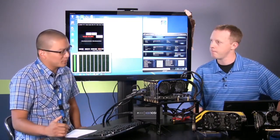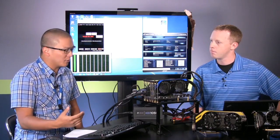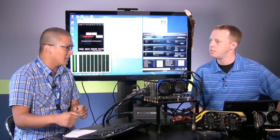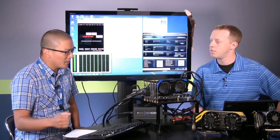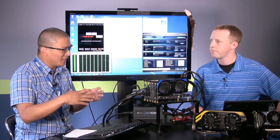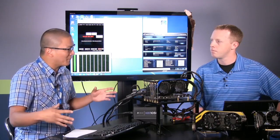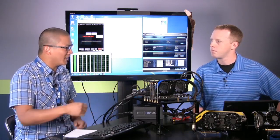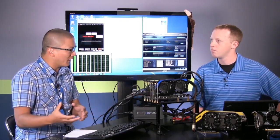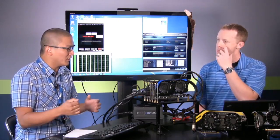From a manufacturing perspective, not every board is tested. In fact, there's a misconception about manufacturing where people think that at the end of the assembly line, somebody plugs every single board into a system and tests it, which is actually not the case. Once you have the assembly line set up, unless there's some deviation or quality control issue, you usually just do spot checks. And there are a couple of electrical leads on the board that you can use to check for electrical continuity and proper grounding, all that stuff. Gotcha. But once those checks are done, essentially the board is shipped.